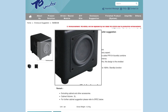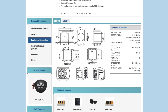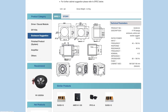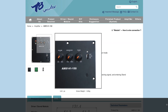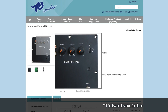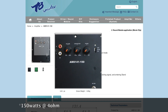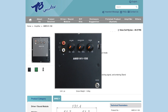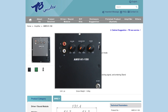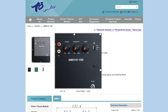They also sent me a small amplifier that goes with this particular build. It's an 80 watt class D amplifier. It has auto on, variable phase control from 0 to 180 degrees, crossover frequency that you can set from 70 to 160 hertz, a volume control, and RCA in. It's a very nice compact little amplifier that I'm going to use with this build.